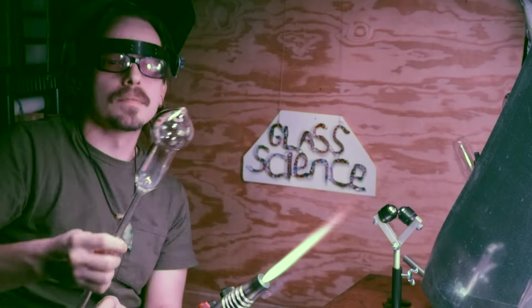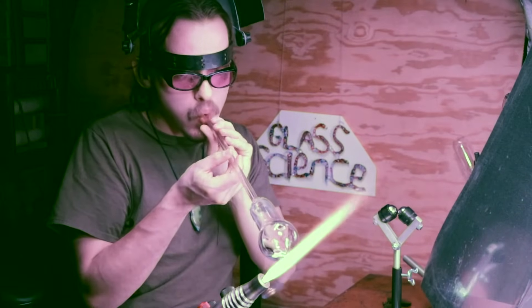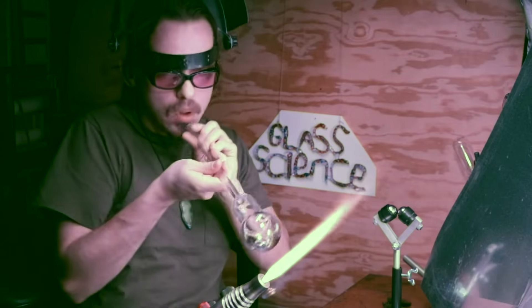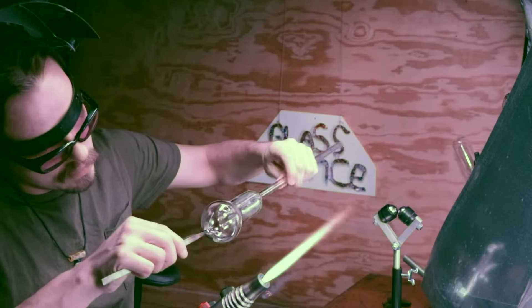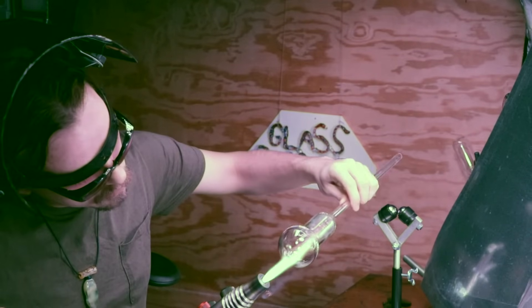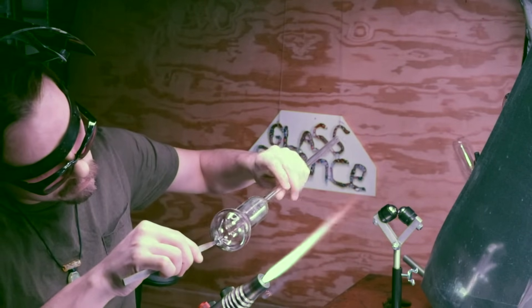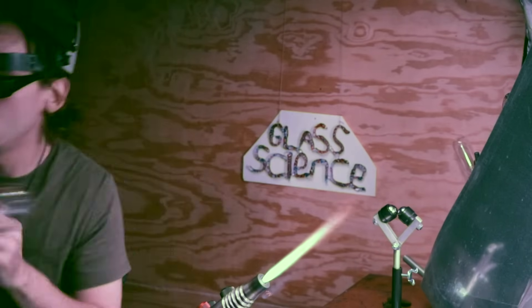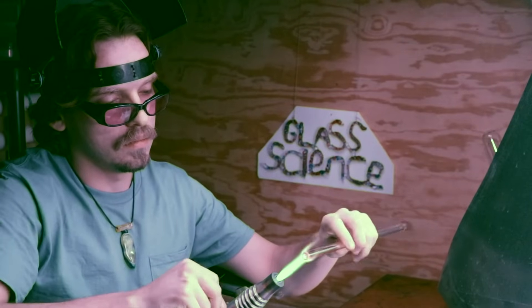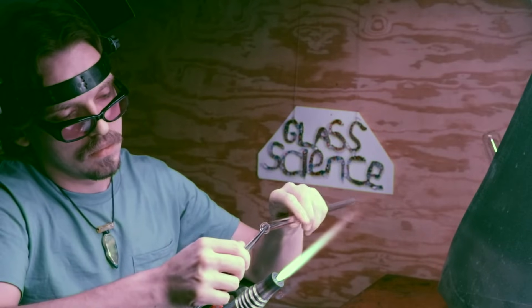I puffed out a little bubble before actually popping the full hole, which I'm going to do right now. I turned up the flame so it'll melt out any bubble trash that comes through. When I use the mini jacks to ream open a small hole to attach the blow tube, it's normally easier if the hole diameter is smaller. For the tubing I'm going to use as a blow tube, I'll give it just a tiny flare — that helps keep it from condensing down and closing up as I'm attaching it.